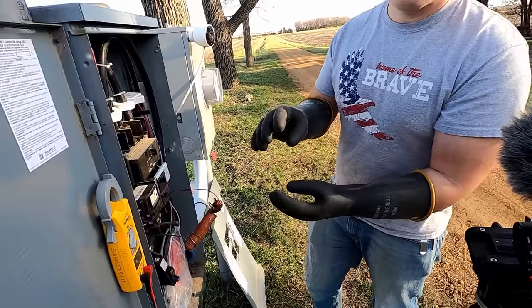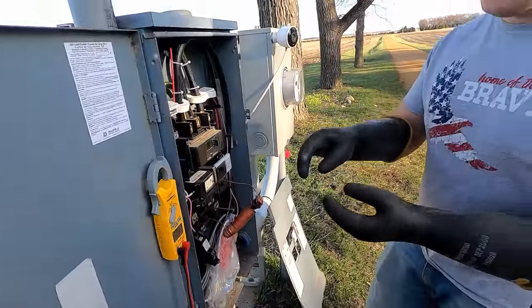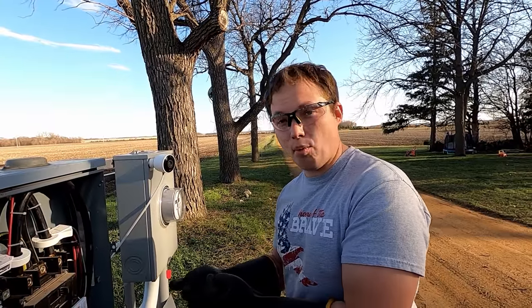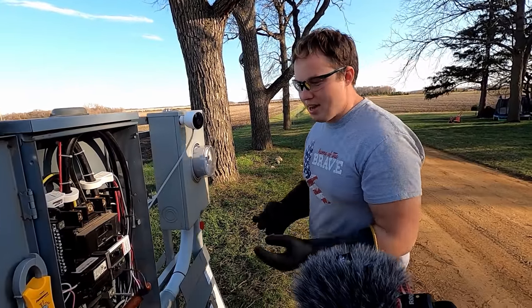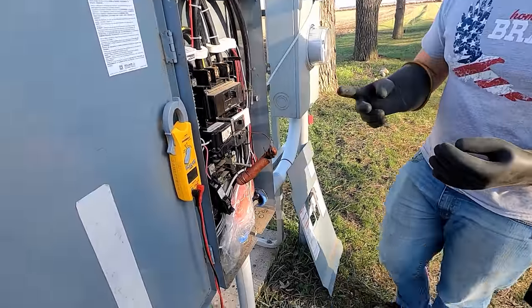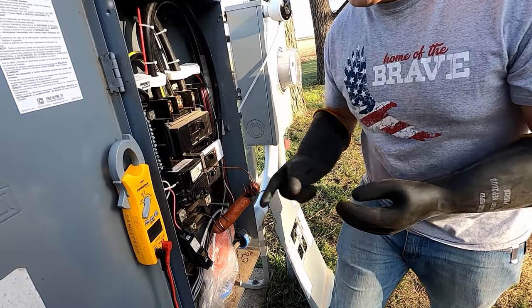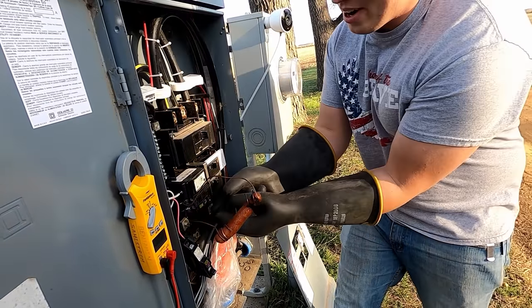This side had more surface area — it was better wrapped around the hot dog than the other side was. So since there was a higher resistance on this side, it started to burn and arc at that point in the circuit. But it never came close to tripping the 30 amp circuit breaker, apparently. We're going to shut this off and then I'm going to remove the breaker.